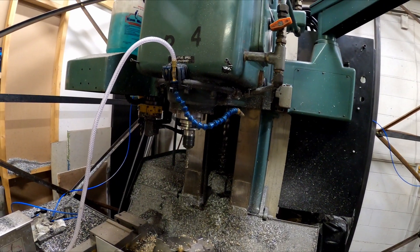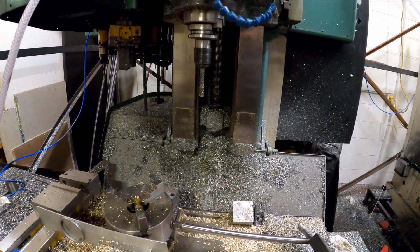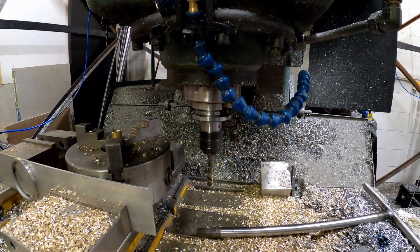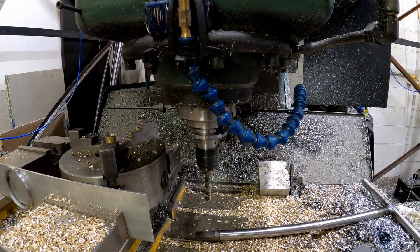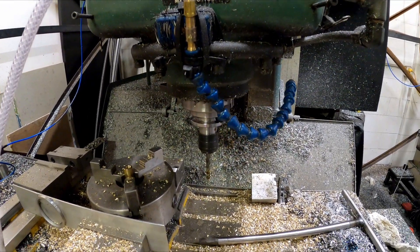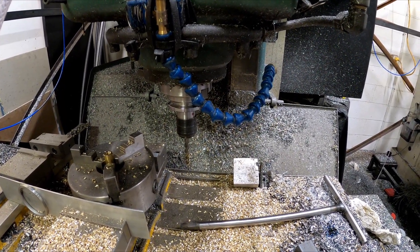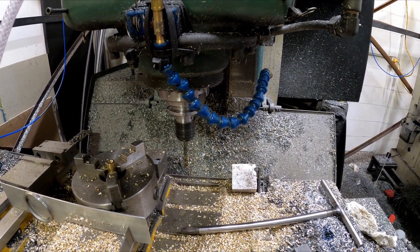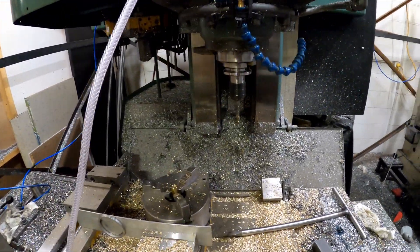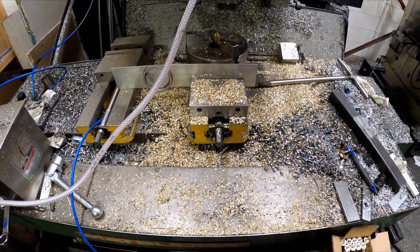I'm going to put it in manual mode just to make sure I don't break my tap. If I move down pretty far — it's not doing it now, but you get a bit of resonance because there's so much slop in the Z-axis. And I've programmed out the backlash. It's not going to do it, but it's not the best. You can sometimes hear when this thing's drilling it's clunking — and that's the ball screw slop. So that really wants replacing.